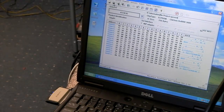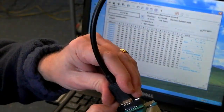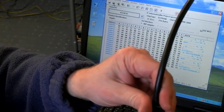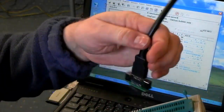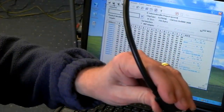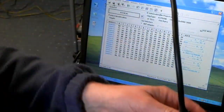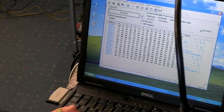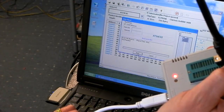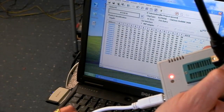You can go off and save that to your desktop or a folder just for your EEPROM dumps. Same again with the VGA — I'm not sure which way around these are as I can't see the back of the set, but they use the same chip. I'm using really thick heavy cables and it's cold out here, which isn't helping. Pop that in, do a read, click on read, and that's it — click cancel and you can see the data has been filled in there, ready to be saved.